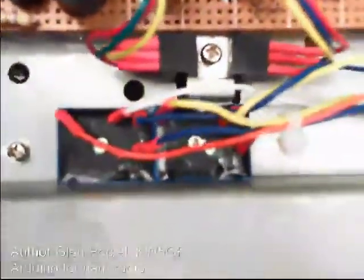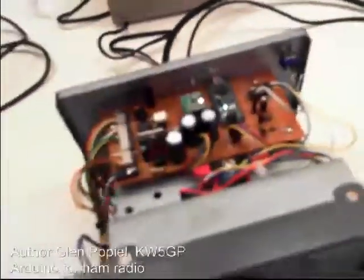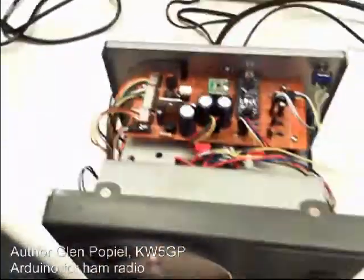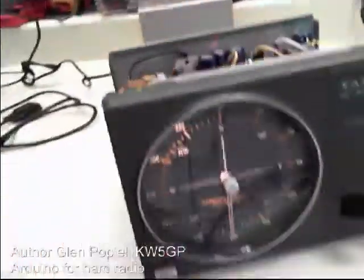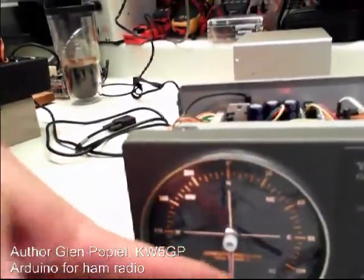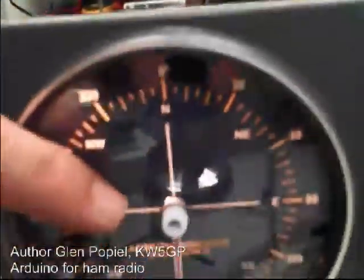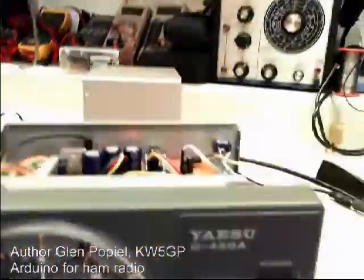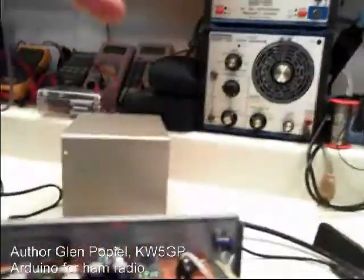And then we mounted two little relays right behind the front cover. This is to drive our left. These are paralleling the left and right switches. And you parallel the left and the right switches. And of course, we've got the motor. Now, what's different between this and the CDE rotor is this is driven by its own little motor and its own little sensor. So not only do you have the rotor turning with its position sensor, you have this turning with the position sensor and the two track. So you have to actually have two blocks of code to make this thing work.